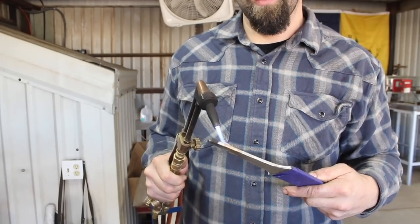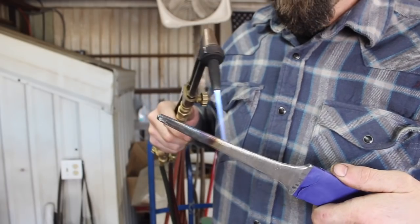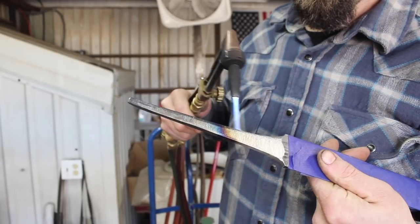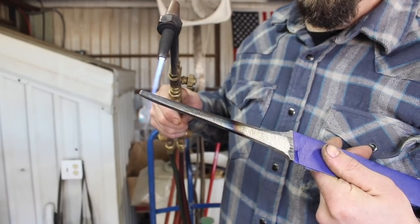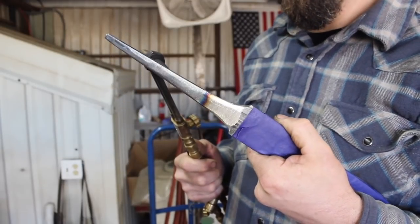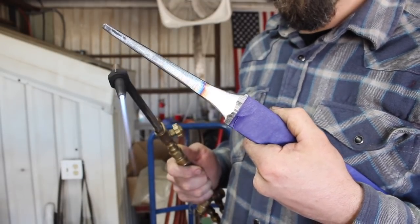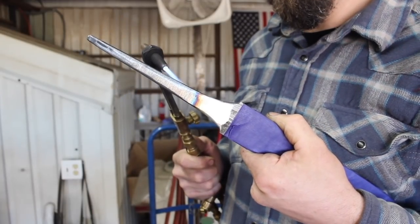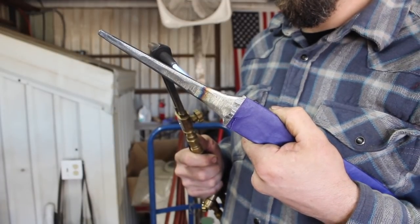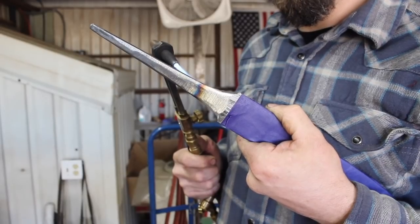Cleaning up the shoulders to fit a brass plate — I wouldn't really call it a guard, but a brass plate up against the blade there. I needed to temper down the steel portion of the tang here, because it was obviously too hard to conveniently file, so I tempered the whole tang out. You can see the tempering oxidization colors on the tang here. As you're aware from the first video, the tang on this blade, like the whole blade, is comprised of a piece of iron and a piece of steel with various steels in that. So half of it has basically zero carbon in it, and the other has high carbon content. However, you're looking at the same color of tempering colors on those two materials.